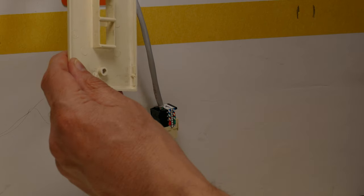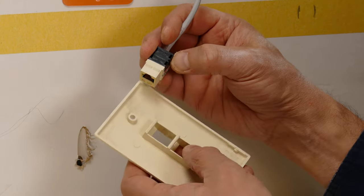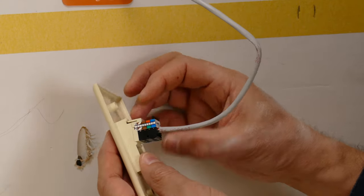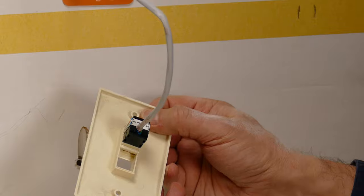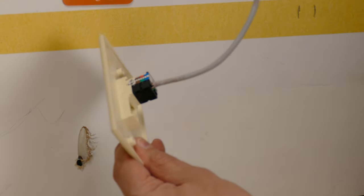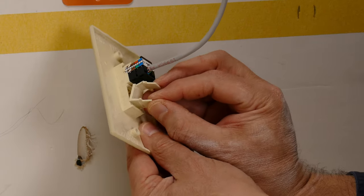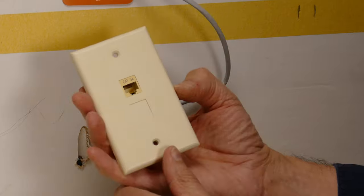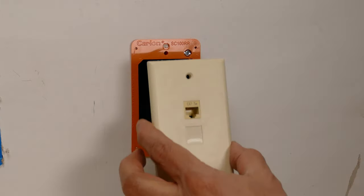Now I have to put it into the wall plate. From the back end you'll notice there's a little lip on it at the top and a little lip over here. You need to get that lip down into the little pocket in the bottom. So it goes in this way — put the lip in first, tilt it in, then help the top along and push it down until it snaps into place. If I had a second one I could put it here, or I could put a cable connector. For now I'm going to put a blank — it has the little part that goes to the bottom, plug it in, push it all in together until it locks into place. Let me take the tape off, push it back in, and then we can screw it into the wall.